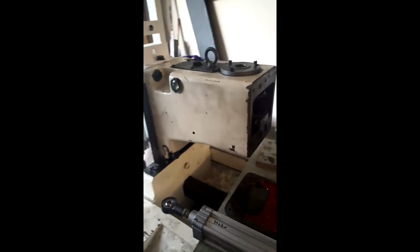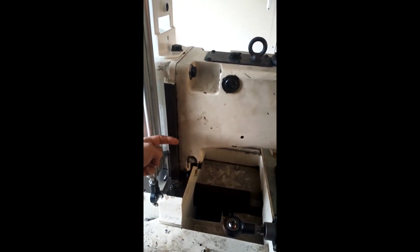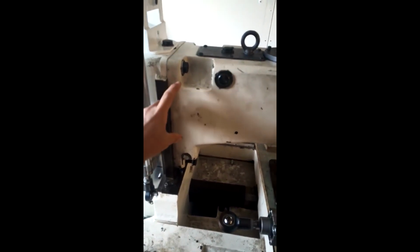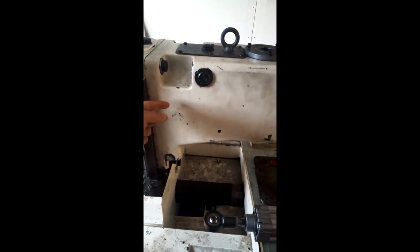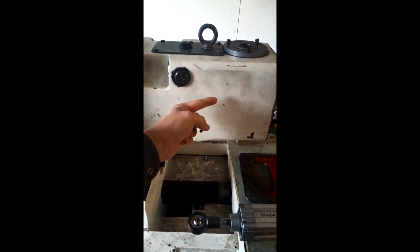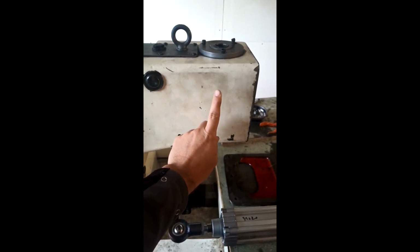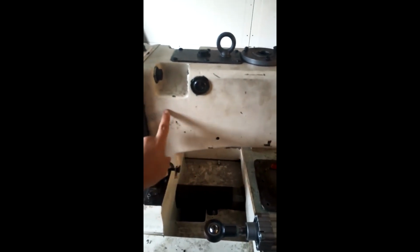So basically, since this is a universal mill, you have the input shaft from the horizontal mode that's there, with the first stage here with spur gears, so that's removed. And then you have a shaft going this way, and a bevel gear that then drives the spindle. So most likely remove this shaft assembly and the bevel gear.